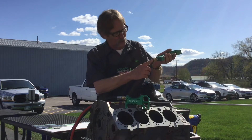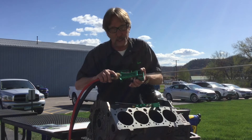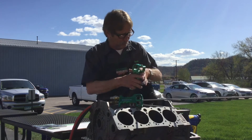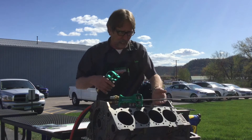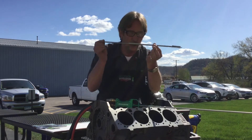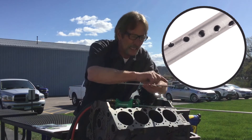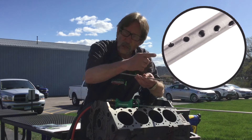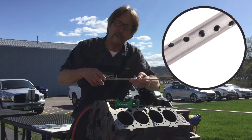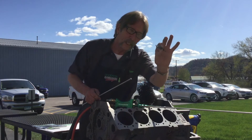This water manifold takes air on one side and water on the other. These buttons work simultaneously or independently to provide air separately, water separately, or a combined air-and-water stream. The thread here accepts either an optional 18-inch wand or the standard 36-inch wand that comes with it. These wands are made out of stainless steel for long life. We've spiral-drilled the wand — you can see that spiral drill — so when air or water comes out, you've already got a spinning, turbo-action aggressive cleaning effect.